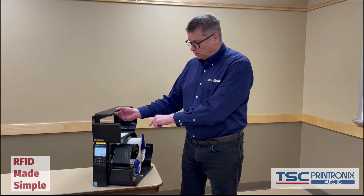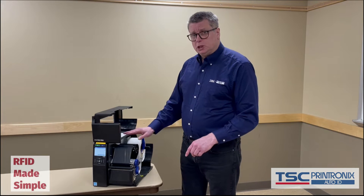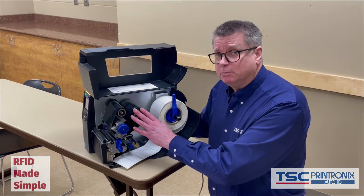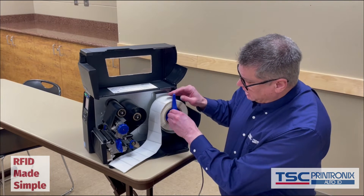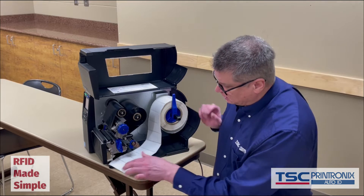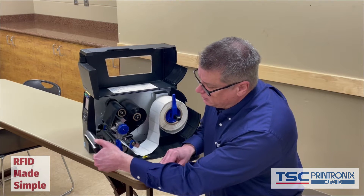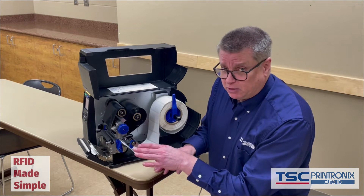Note the bifold door, which can give you a smaller footprint needed for the printer. When we talk about media, we're normally talking about ribbons and labels. I've pre-loaded the ribbon, but I'm going to show you loading the labels. Just put them on the back panel here, adjust the guide, slide it in gently to the labels. I then run the labels through the feed mechanisms. The front panel door allows that to open up, which allows easier label loading, especially with on-metal tags.